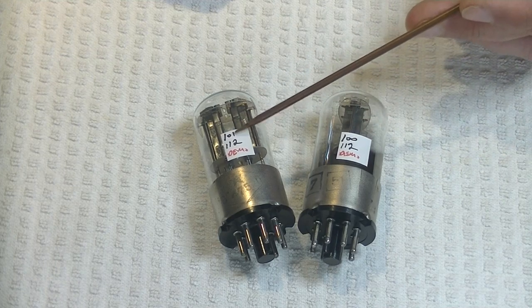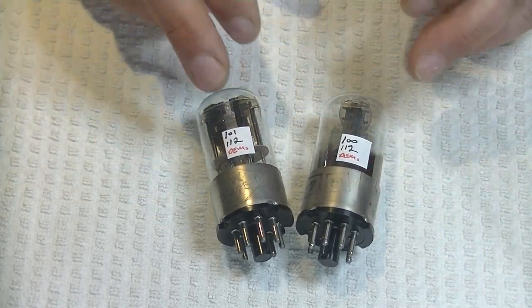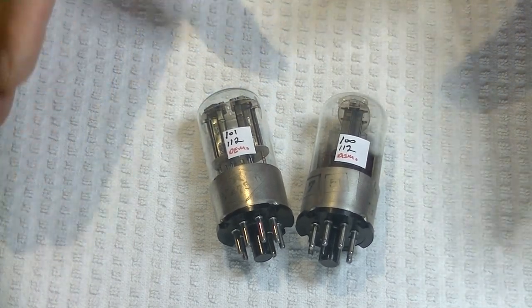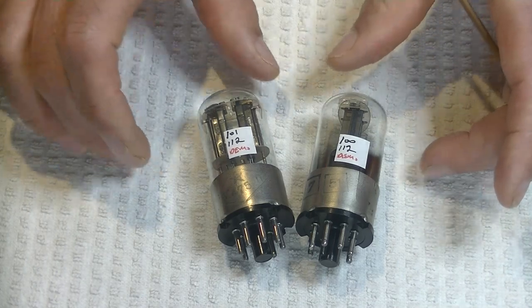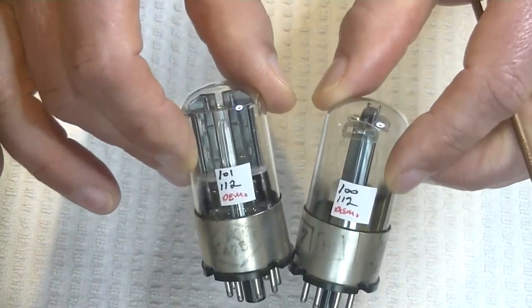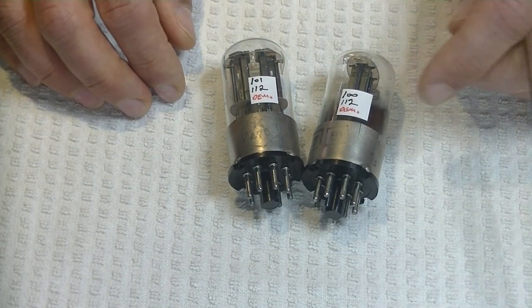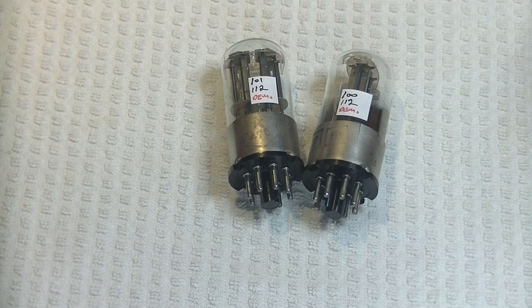It will work fabulously. Look — we're 1% on the first section. Remember, it's the first section of both tubes that will be handling the first stage on the left channel and the first stage on the right. Same circuit, different but identical electronic components. And the second stage would be 112 and 112. So if you have good actual testing numbers and they're organized like this, that is perfectly acceptable and it'll work just fine. It might hurt your aesthetics to see those numbers on the testing tabs, but just take them off and forget about them. Your amp won't care — it'll say, that's a balanced tube, and it'll sound great.